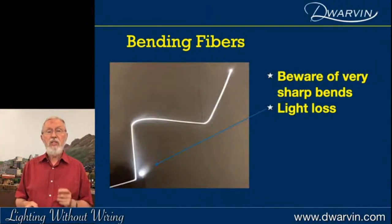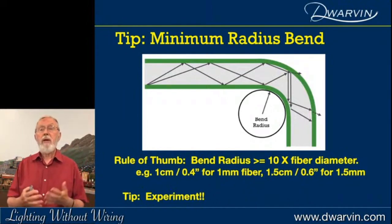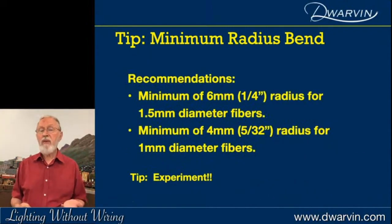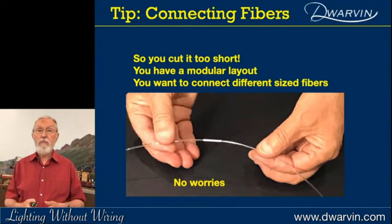Do be careful, because if you make too sharp a bend you're going to lose some light. What's going on is the fiber holds the light in it and the light bounces back and forward, but as soon as it comes to a corner and the bend is too sharp, you'll lose some light. I have guidelines for typical bend radii: for a 1.5mm fiber I recommend a minimum radius of about 6mm, and for a 1.0mm fiber it's about 4mm. But experiment with it — on the Christmas pub display I had the fiber coming up a drain pipe making a fairly sharp bend and I still had plenty of light.